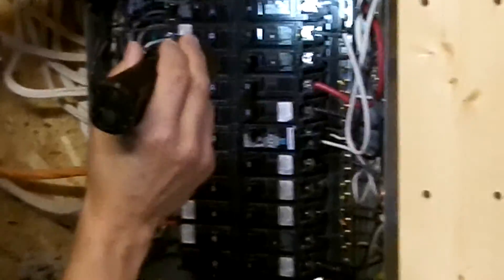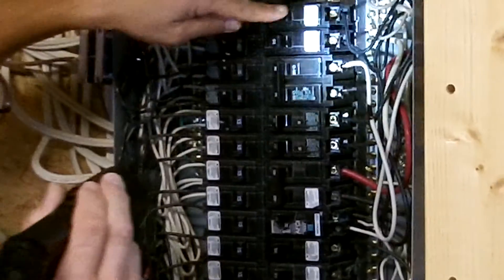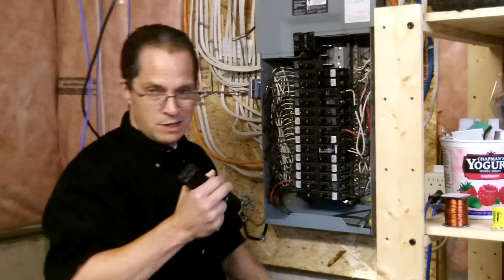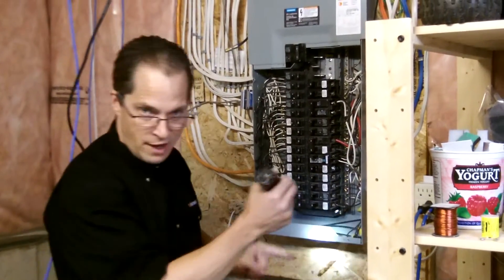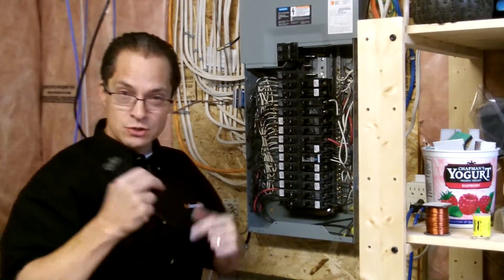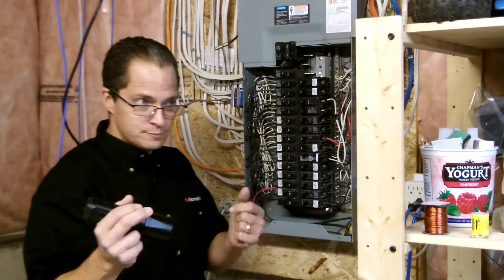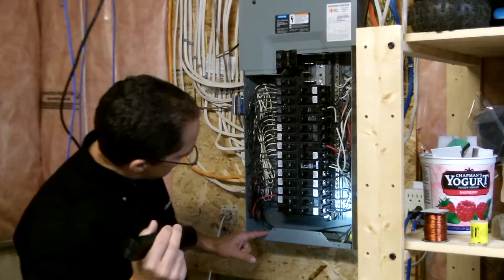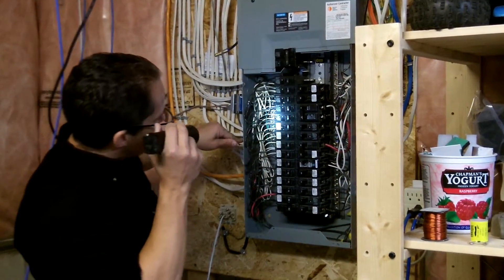Scanning through, looking for doubled-up circuits. There should only be one wire under each screw terminal. As we move through the panel, we can see right at the bottom there are two wires going under one screw — a double tap. Not a big deal; it's in probably 95% of the panels we look at. We still note it, because you can be sure somebody else is going to look in this panel and say they should have shown you that double tap. I have that conversation with the client and they always get a good chuckle out of it. As soon as they chuckle, that gives you full permission to nitpick.